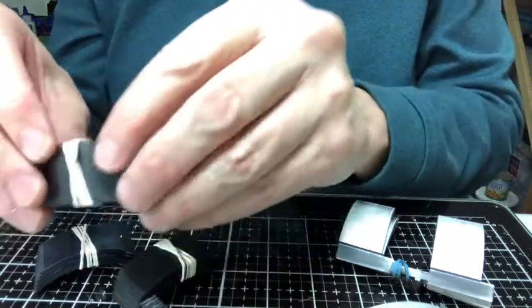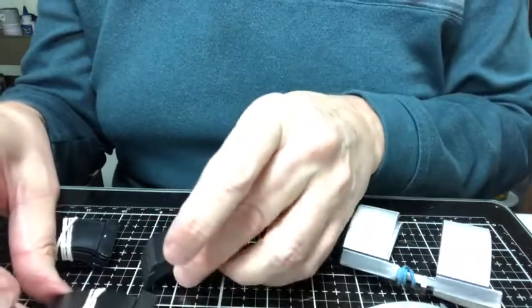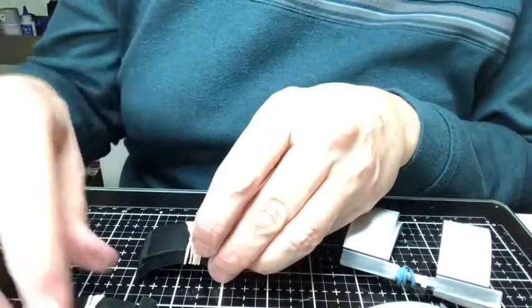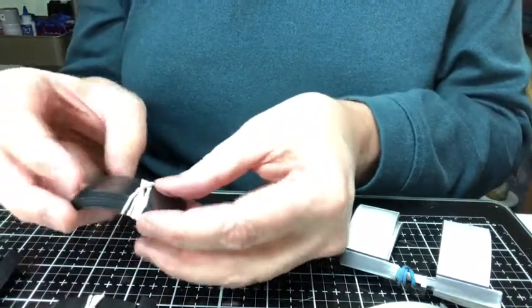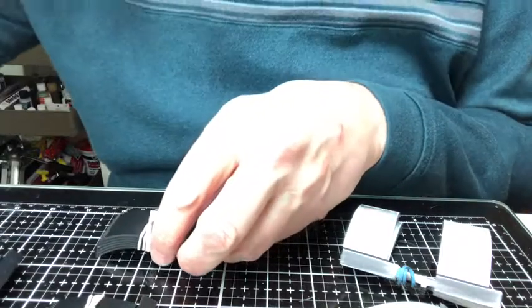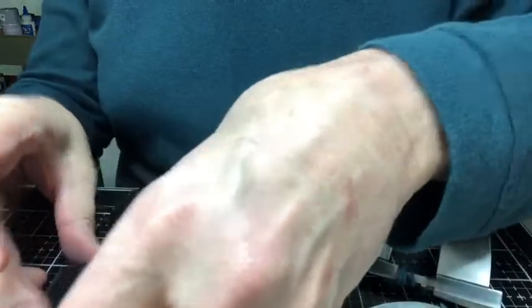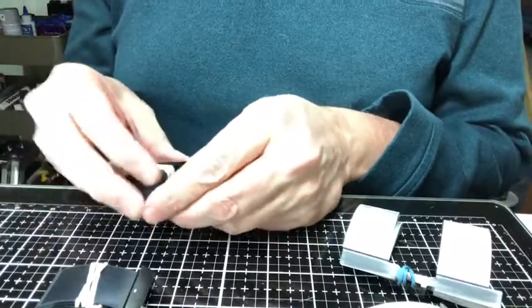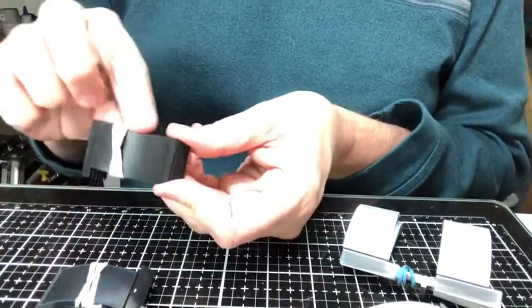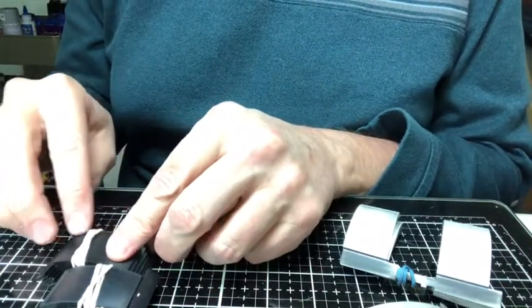The way that this has to go, you start off with a double rivet. Okay? You then, according to the directions, put in a no rivet row so that you have no rivets on both sides because they're going to be done on that. You then come up with another double rivet row. Okay? So double rivet, no rivet, double rivet, and then finally, in order to ensure that you get a nice smooth top, you finish off with a single rivet with the single rivets being up on the top.